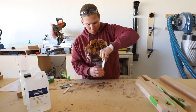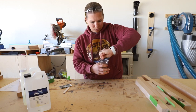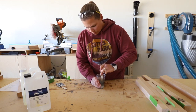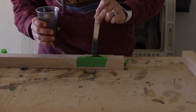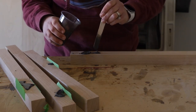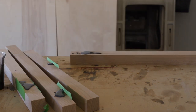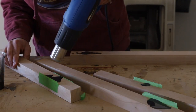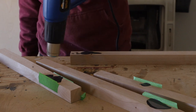I mixed up about two ounces total of tabletop epoxy and then used a dark gray pigment powder for coloring. You can use any coloring you like or just leave it clear. Once my epoxy was mixed up I drizzled it over the knots in the legs, taking my time and letting it seep down into all of the knots, then refilling as necessary. I also used my heat gun to remove any air bubbles that occur when you're mixing the epoxy, then set it aside to dry.